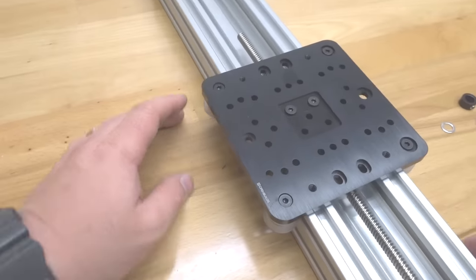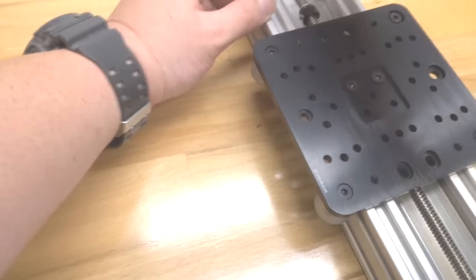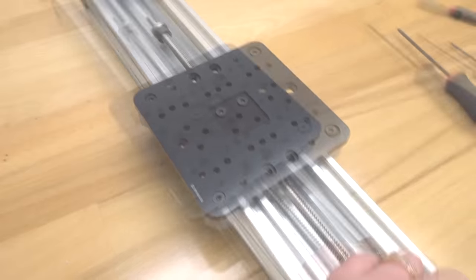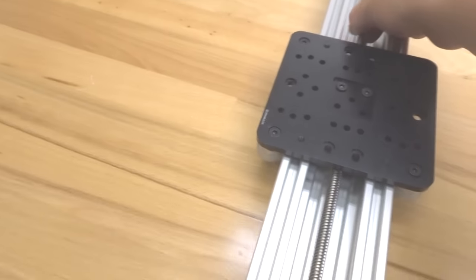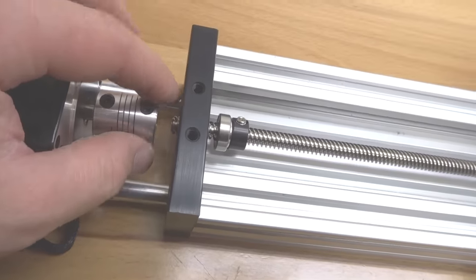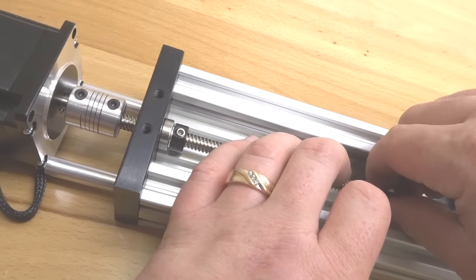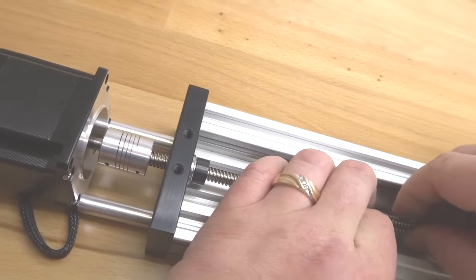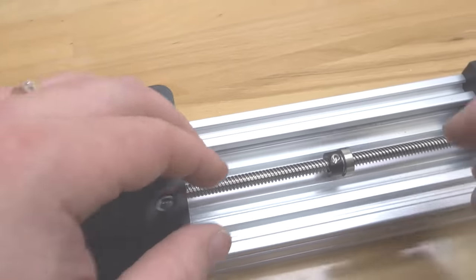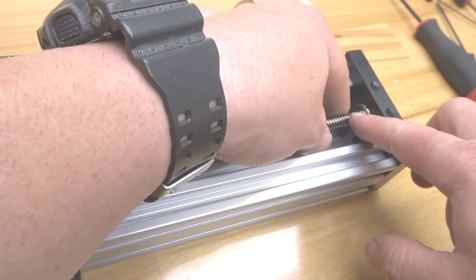On the opposite end, add your additional parts: lock collar, 8mm shim, and 8mm bearing. Rotate everything all the way to the opposite end of the actuator. Turn the system to the side — the lead screw is going to attach to the flexible coupling as it protrudes out of the end mount. Continue rotating until it gets into the flexible coupling and locks into place — you'll see the flexible coupling rotate, which is exactly what you want. On the opposite end, the lead screw should be flush to the C-beam end mount.